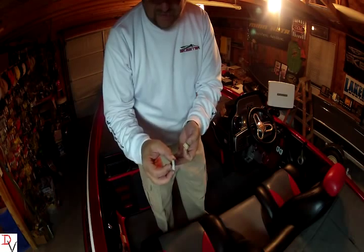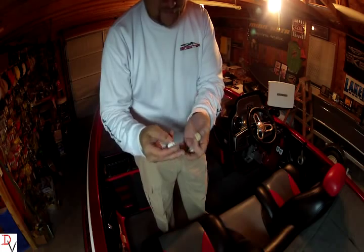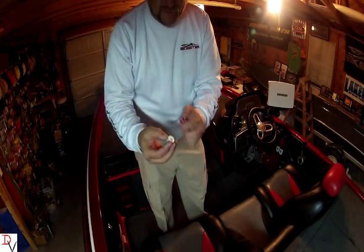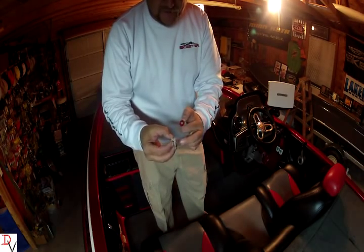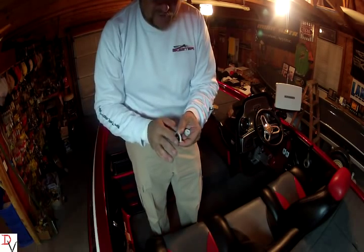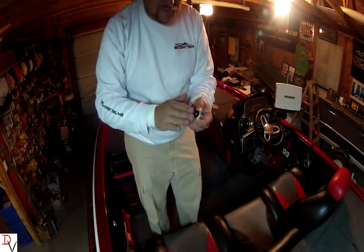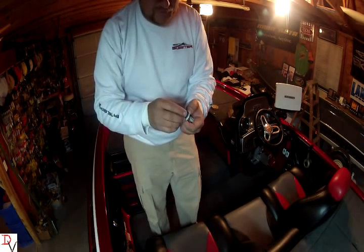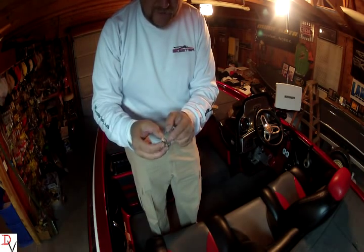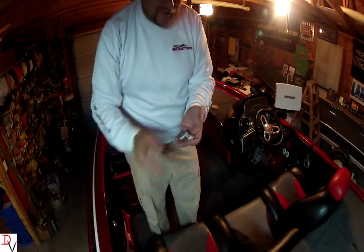This is the back top cap. You've got your outer surface and then all those layers of fiberglass. Your gel coat is sprayed into the mold first. Then your flake — doing a dry flake, all your flake lays flat and you can see that. Then your fiberglass is laid. This is the last part that's laid in the mold. Basically a boat's built backwards from the outside in.